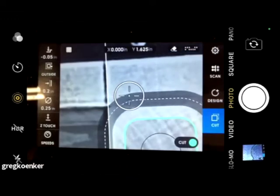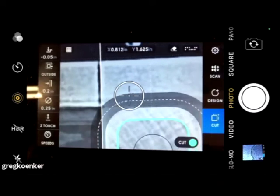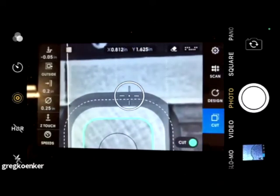That was my question. You could make it 0.22, you know? I'm all about fudge factors. Trust me, there always has to be a fudge factor. If you were trying not to go there, you have the exact right approach. You would use a smaller bit to get closer to those edges, and if you can't get in precisely into that edge, you might have to use a chisel for the few hairs. It would take longer. Yeah, cool, perfect.